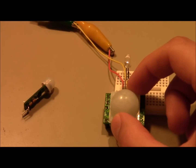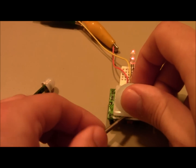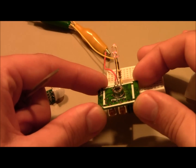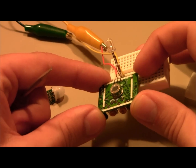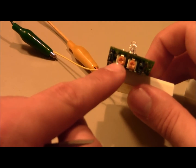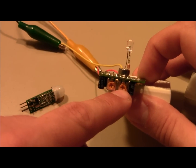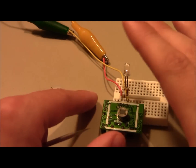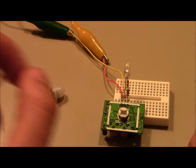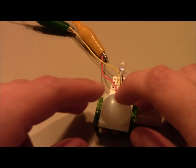Taking the lens cap off of one of them, you can see the actual sensor is in a TO5 case — one of the metal cans. This module happens to have two adjustment potentiometers on it so you can turn up or down the sensitivity and the pulse duration. When it senses motion it sends out a pulse, and after the pulse it does a holdoff where it will not send another pulse until it waits a certain amount of time.